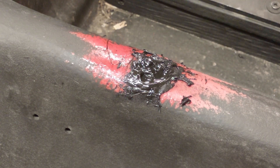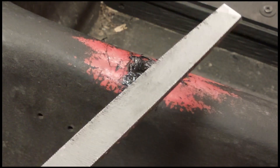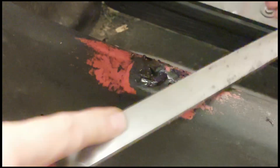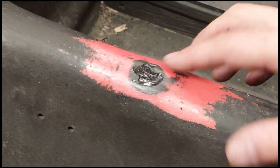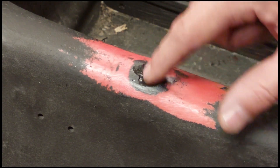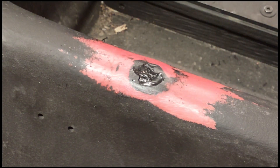I'm really happy with the way that's turning out. It kind of looks like a big ugly mess right now, but once it cools it's very easy to shape with a knife or a file. Our working piece has cooled and I'm just going to use a single cut file to start shaping this. It shapes up quite nicely with the file. There's still a little bit of an indentation there, but now I have a good solid backing. I'll basically repeat the process, fill that in again, do a bit more filing, and then we'll be ready for paint.